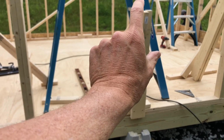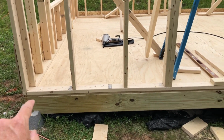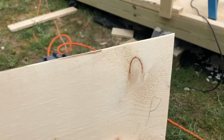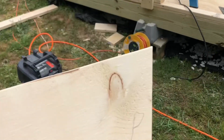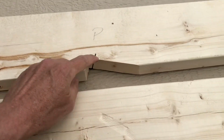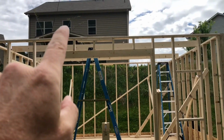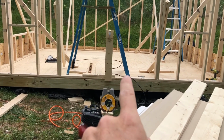And then we'll have the rafters come off of that, and I'm building that now, and they'll come down and sit on a small bird's mouth. So what I did was cut a pattern. This is the pattern. I marked it as pattern. And so this is going to be up in that groove. It's going to match right up on that simulated ridge rafter, and that angle then will work. And at the other end, I cut this called a bird's mouth, and this will sit on the top plate of the wall up there. So then we'll have the A-frame goes up and the other one comes down the other side. I'll show you that in a minute, but I'd rather build it here or do a pattern down here.